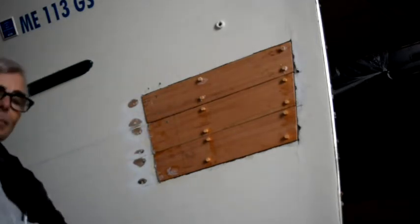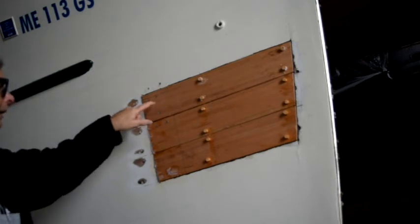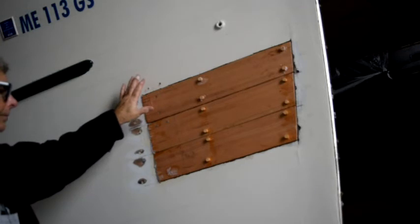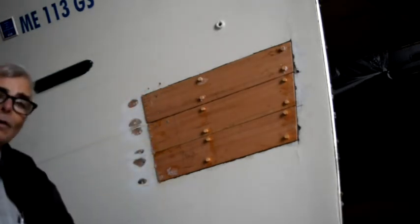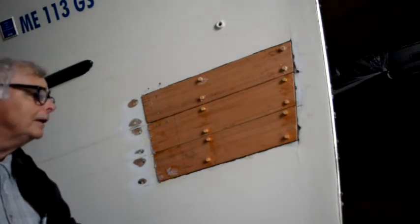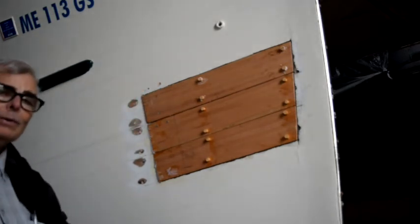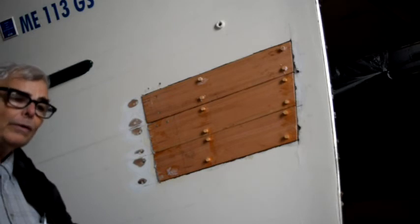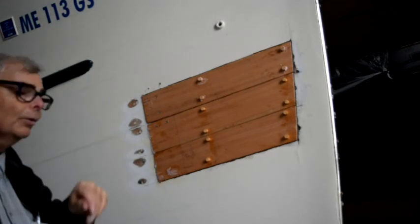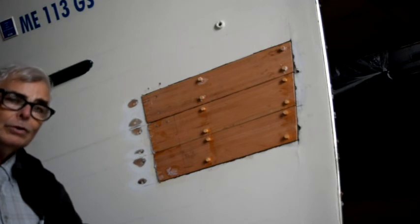Even though I've got three plank ends lined up here, since this is one plank, this is another plank, and after the epoxy sets this will be another plank — there is, for all intents and purposes, no joint here. The spacing of the joints really doesn't matter when you do an epoxy scarf joint like this. It looked pretty daunting when I first cut this hole in the hull, but it really isn't a particularly difficult task or all that time consuming, except that because you're epoxying things in, you do need to let them go for a couple of days when it's cold to let the epoxy cure before you do the next plank.